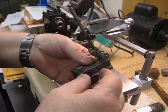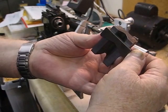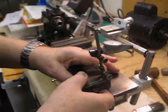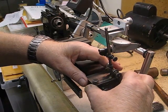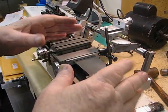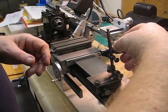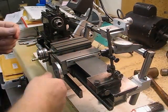The scribing block comes with an accessory — a little bridge that fits around it and slides backwards and forwards, enabling you to place the scribing block and come up to a straight edge. The lathe bed is very accurate, so I'm going to use the lathe bed as my reference, which is the best possible way unless you have more expensive equipment.